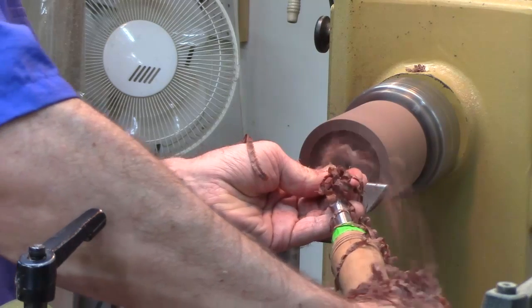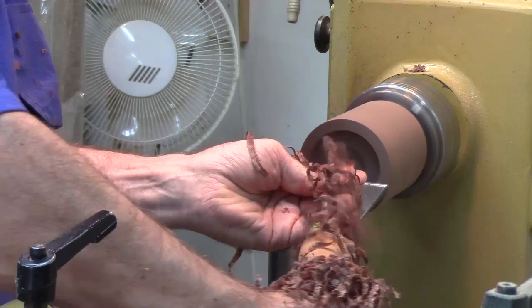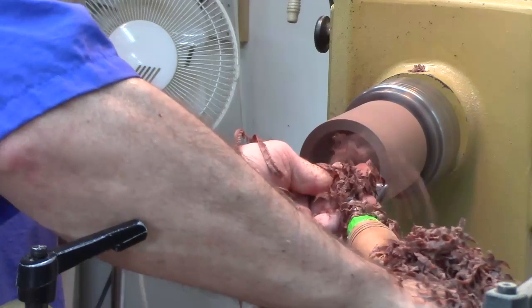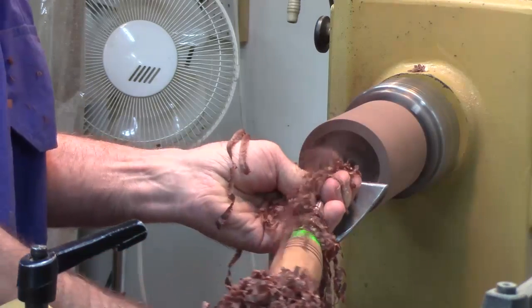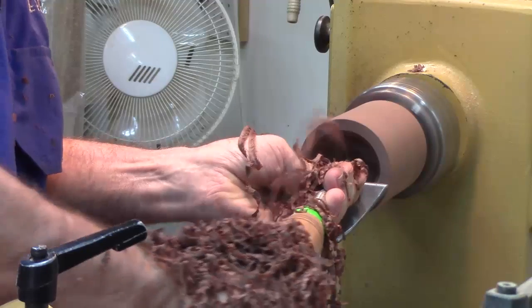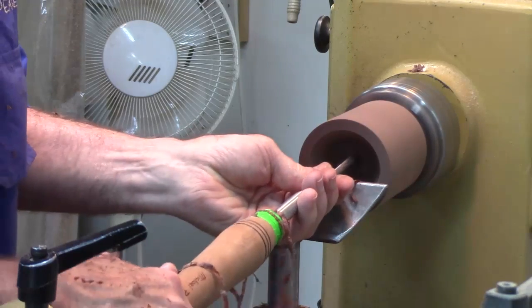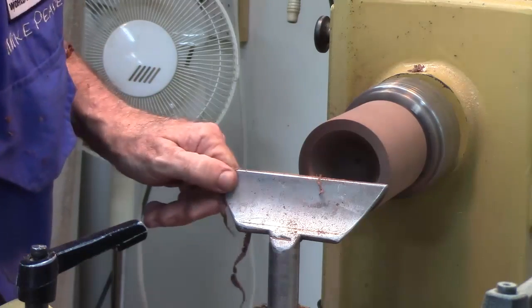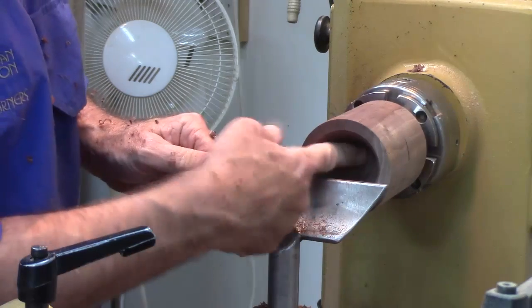Ooh, there's the streamer. It's almost sharp, it'll almost cut. This looks like it's sharp. As I'm reaching further over the tool rest, I can feel a little more chatter and tool bounce. Closing the flute a little bit more, so we take some sweeping, cleaning cuts.